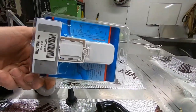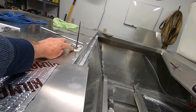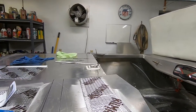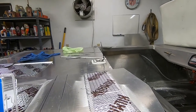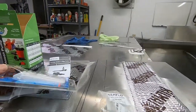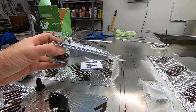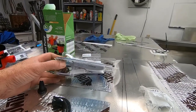My thought was to use this marine sealant. I put some on a few days ago and it's crusted over but still soft in the middle — takes a week to cure in this 60-degree weather, especially when it's thick. But once it cures it sticks really well if everything's clean and scuffed up, and it's not just going to pop off with vibration. I'd feel pretty good about cleaning the metal up, squirting a bunch of that on the bottom, sticking the pump down, and giving it a week to cure. I don't think it's going anywhere.